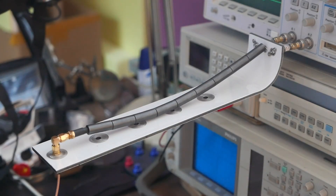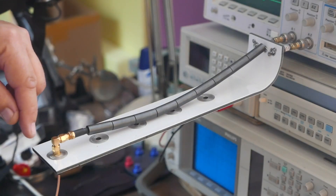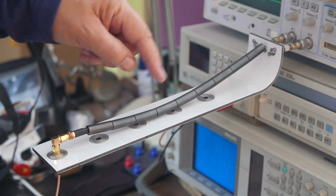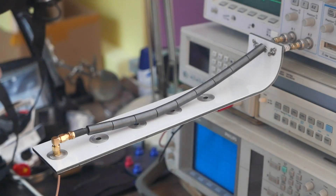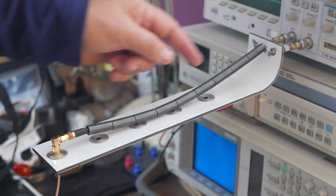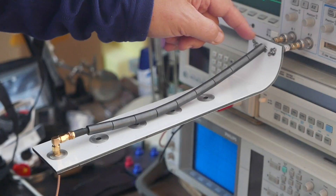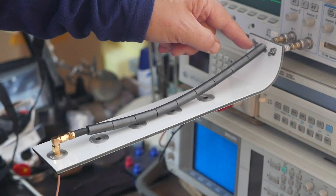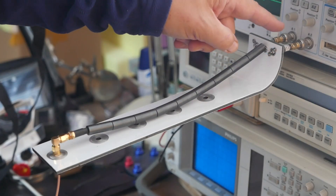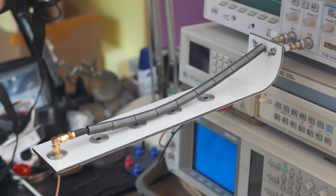This is the test setup — we've replaced the calibration cable with the balun under test. We've got the signal coming through this line of ferrites, wrapping the ferrites around the cable. These ferrites will allow differential current through because the magnetic field from the differential current sums to zero, meaning the ferrites won't impede it. At the end we have a balanced voltage, with an output taken from the shield and from the center core going into the X and Y inputs of the oscilloscope.